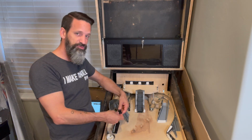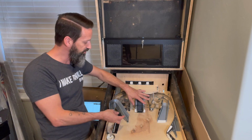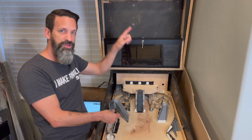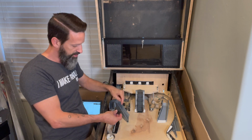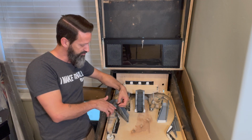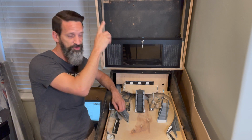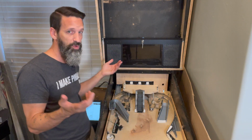So you're going to go through and add a switch. I've got a micro switch that I added in here, and it's set up underneath my stepper motor, so every time my stepper motor steps and rotates to a certain position, it hits this and closes the switch, and that way I know I'm in a good position. I've wired it up just like any other switch. It goes to my FAST control boards in a switch input with the ground return, and that way I know when we're at home position.